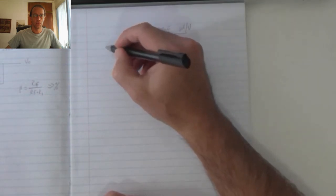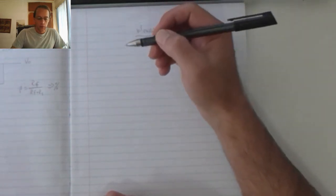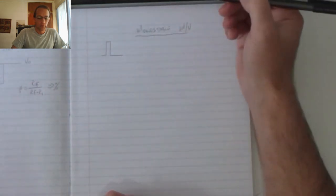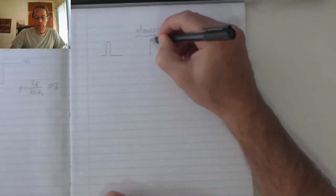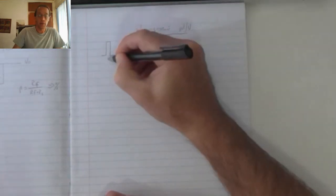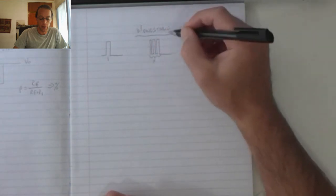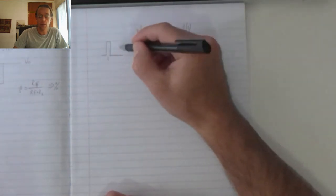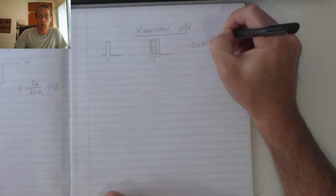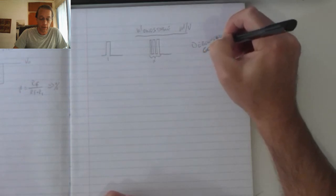Now what happens sometimes is when you press a button, what actually happens inside the button due to the elasticity of the contact is instead of a signal like that going through to the device, the two metal contacts bounce on each other, and as a result, instead of sending through one signal, we are sending through multiple signals, which in a device could be read as multiple signals instead of the single signal. So we use it for debouncing of contacts.